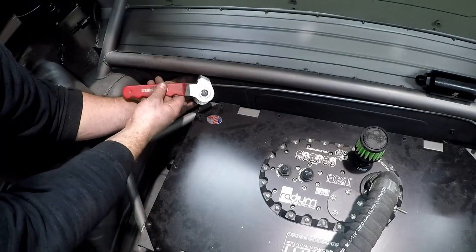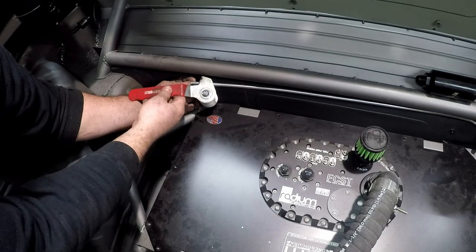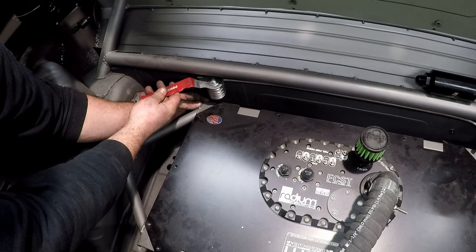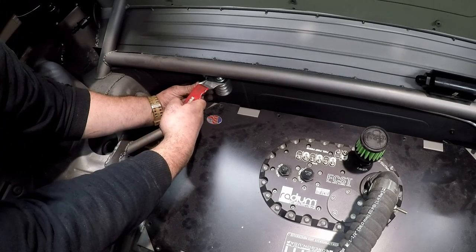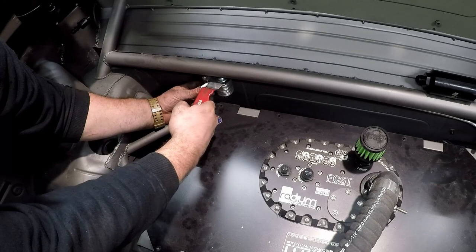This is the tool I've been using to bend the tubing. It makes a nice smooth bend and doesn't kink it too much. If you do maybe over 90 degrees you risk kinking it, so if you need to do 90 degrees I always bend it in two spots. I just put it on there and bend the tubing to the angle where the nozzle would point toward the center.